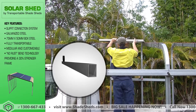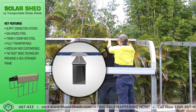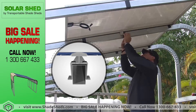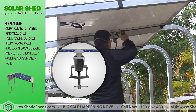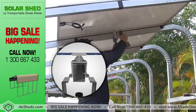A rubber seal is placed on top of the frame to prevent water leakage. Place the solar panels on top of the rubber seal, then place the included bracket over the solar panel frame that connects to the shed frame. Slip over the included clamp and tighten it to pull down the panels to the frame. Place two tech screws on each of the brackets to hold and secure the panels in place.